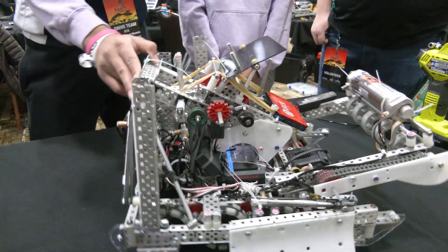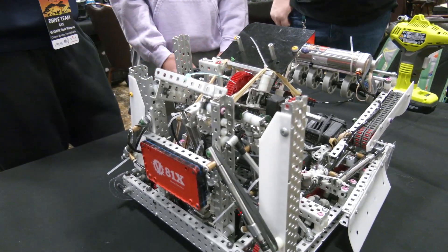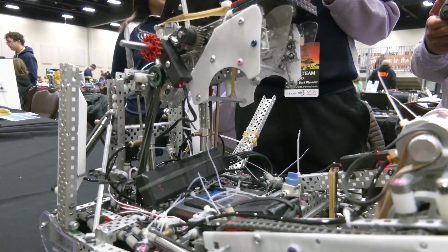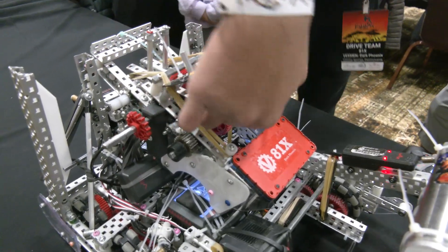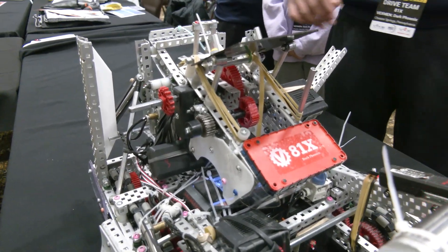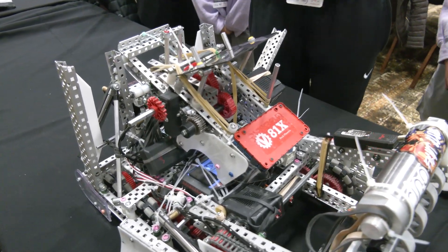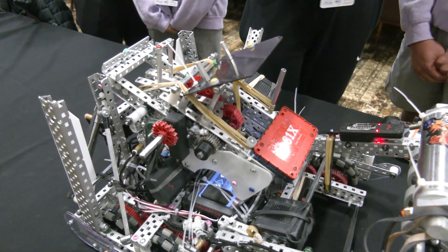In order to do this, we first had this tower here and then a kind of lift system which just goes up. This plastic right here goes around the bar and when we pull it down it gets easier because it comes all the way up. When we want to use the kicker — which is barely ever, only in skills — we just have one motor going from here to here, and it's double slip because we want it to go super fast when trying to kick balls in skills so that we have more time for the actual route. We had a catapult for Sugar Rush which was barely ever used and just extra weight, so we made this simple kicker with a 100 RPM motor — you just place the ball right here and it keeps shooting back and forth.